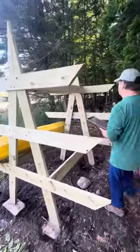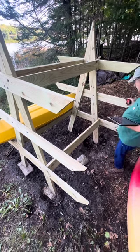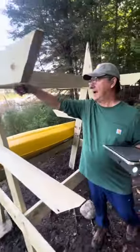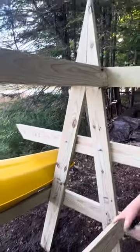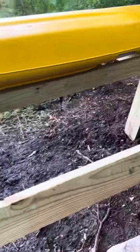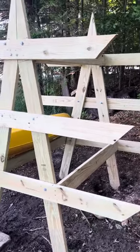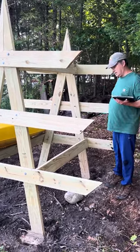Now we're on step nine. We're going to gently slide them over and take the ten-foot boards cut in half — the four or five-footers — and stand them up. You're going to need some help with this. Stand them up and put them in place, and put perhaps two deck screws into the A-frame on both sides, just to steady it. Take your other two five-footers and lay them on the ground so that your feet are vertically level and at about five feet. Do not try to screw those bottom supports in yet — lay them on the ground and make sure your feet are five feet side to side. Then screw them in with four screws and you're on your way.